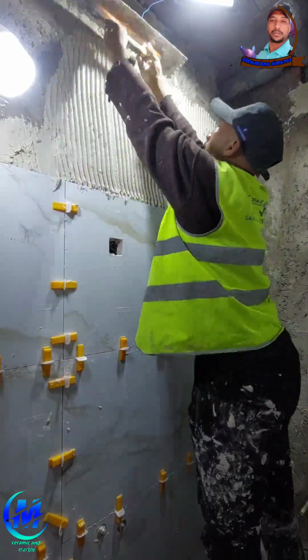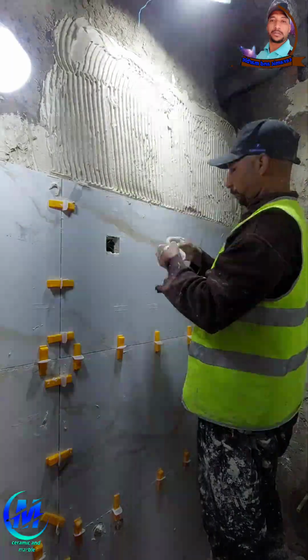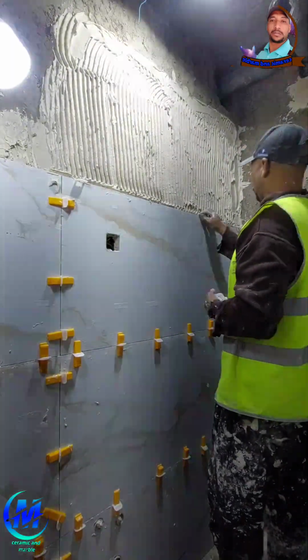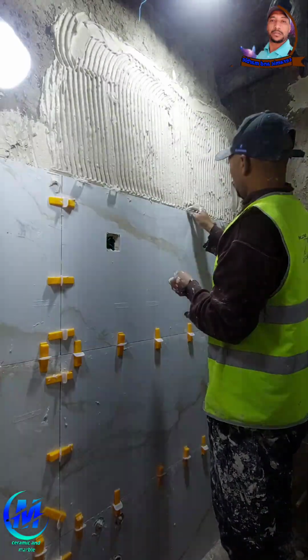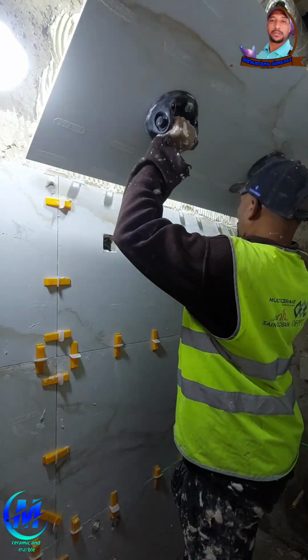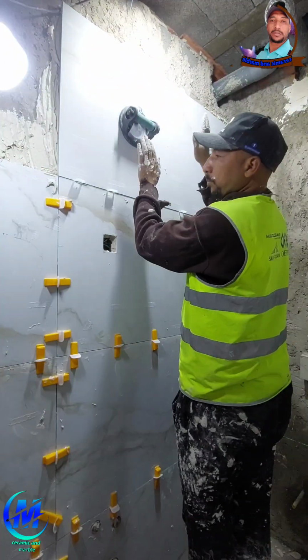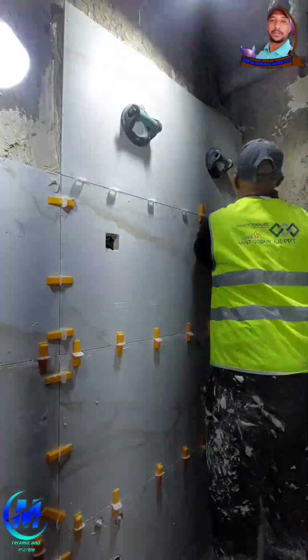4. Snap that first line. Set your anchor now. It's time to lay the groundwork for the first row. Use a chalk line or a laser level to draw a straight line on the floor. This line should run through the center of the room or follow your adjusted layout. Make sure it's dead straight. Even a 1 degree shift will create a visible curve as you move across the room. This line will guide your entire installation, so take your time.